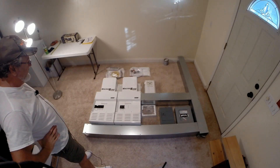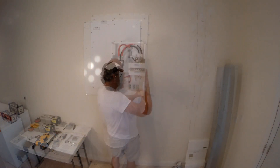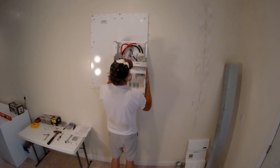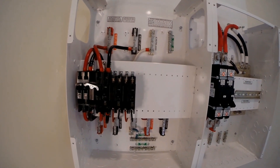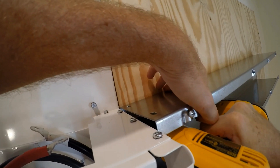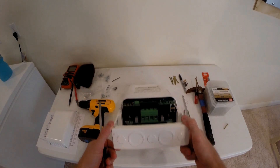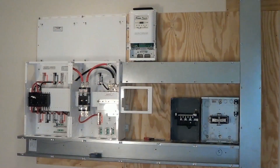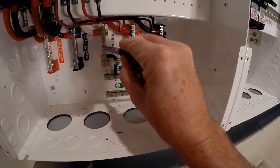So here's a little bit of that process. This is basically the power wall — everything will just mount right up there nice and easy. The charge controller runs through there, out to charge the batteries from one panel to the other. It's the AC side with your input AC. Components like the charge controller — I marked off where the knockouts have to go for the cable to run through.